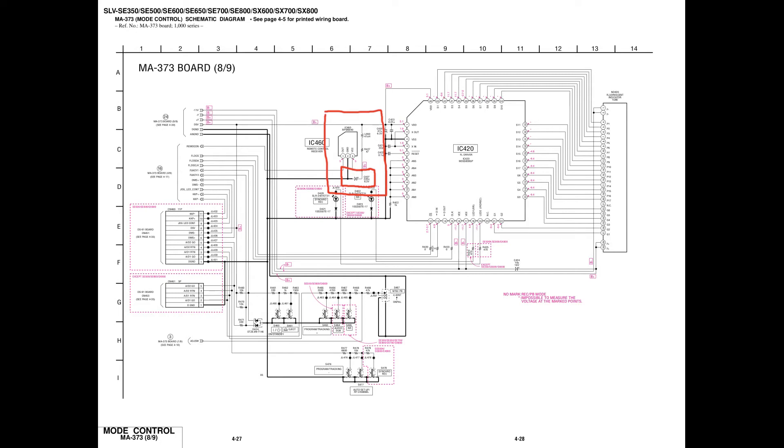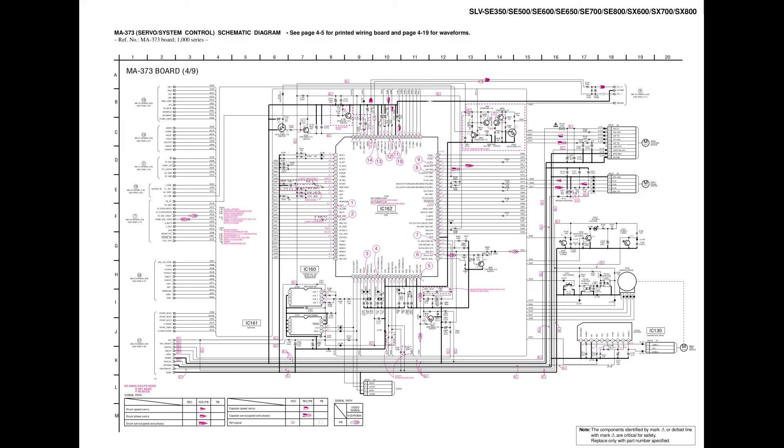Just to be sure, let's check where the output of this device goes. We need to look at another sheet following the output here, which I've highlighted in green. On this sheet we see this connection coming in, joining some sort of bus and being fed directly to the main control IC. So there's very little circuitry in the way. Everything else on this recorder is working so I don't foresee a problem with the actual controller — we would see other issues. So this all points at that one capacitor, which is probably in a horrible-to-get-to location and requires disassembly of the whole front panel of the VCR. This may turn into a part two video, but mostly I hope this just provides a reasonable how-to on fixing common problems with remote controls.